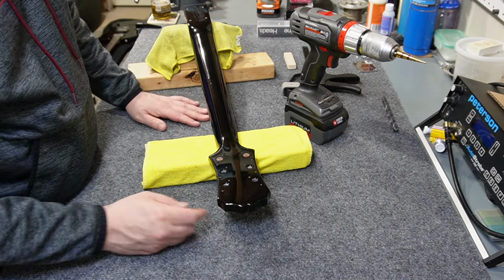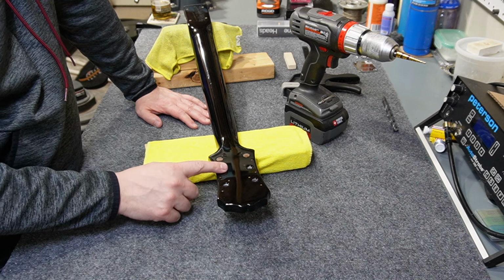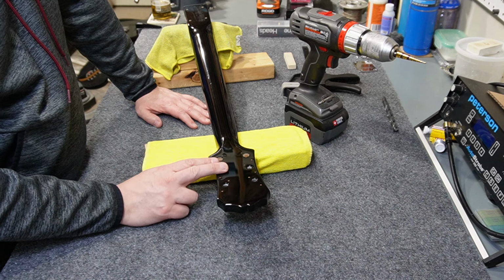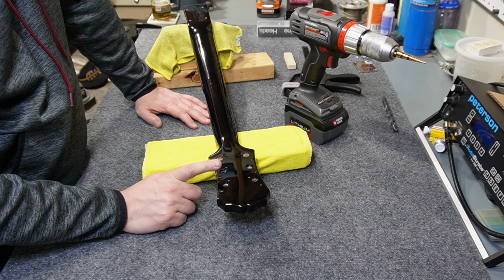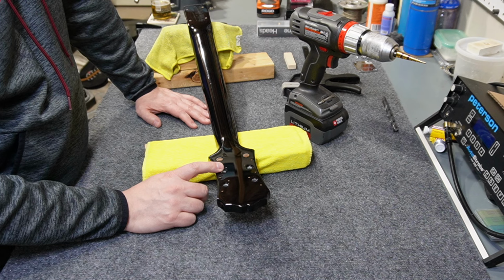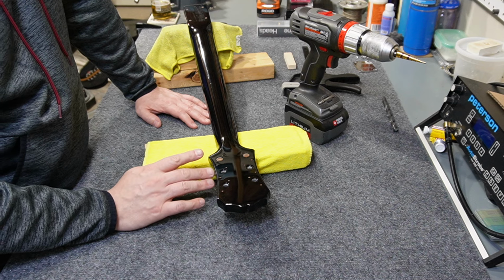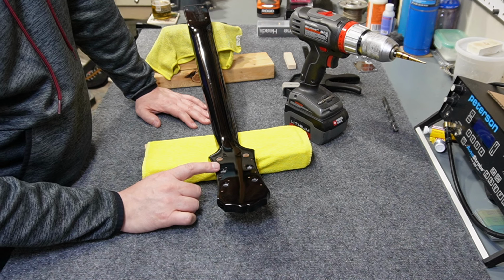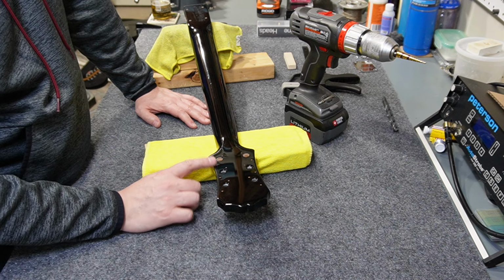What I'm doing now, I am preparing for modern tuners on this neck that actually had holes for vintage style tuners. And they're probably 2 millimeters or so wider than the original holes. I'm drilling these things out to an 11/32 bit because that's what I have on hand. I know a lot of people prefer reamers on these, but I actually prefer to use a stepped drill bit. And I did this on one other project previously, so if you've seen this before, I understand. But this is a pretty simple procedure, and the stepped drill bit helps me keep the hole centered in the old hole so that all the tuners stay aligned.